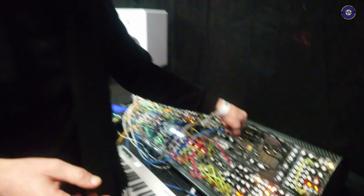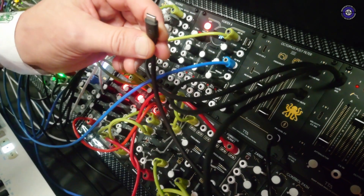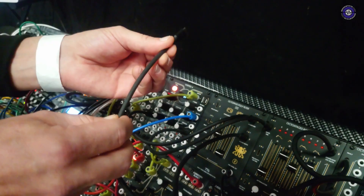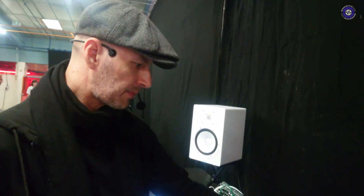It's the same cable you would use in a Eurorack system — any mini jack cable — and it carries note information. The USB-C connector, which is not a standard USB-C cable, has nothing to do with ART. The USB-C is just the connector because it's small enough for the Eurorack system. It carries bus information — it's effectively a multi-core audio cable, like a normal audio snake with eight cables inside. It is a special cable because it's shielded audio cable; a regular USB-C cable is a data cable and not shielded properly for audio.